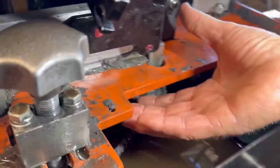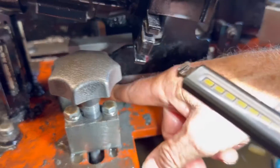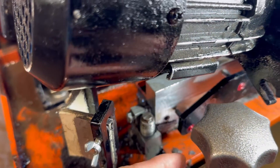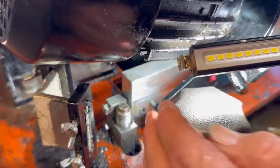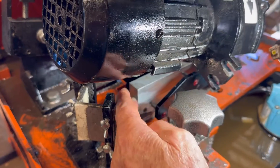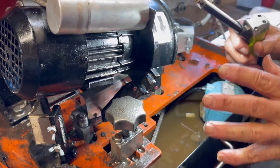In the case of this machine, there are two bolts right under here at the end of where this finger is — a bolt that goes through this block. You loosen that bolt and one right here, and then you can pivot this blade guide plate. You can see there are notches which allow the blade clamp to move forward or backwards to align it with the three bolts in the alignment tool. Once all three are flush with the plate, the machine is aligned. On this one, the closest pin was touching, the middle one was not touching, and the far one was off about a sixteenth of an inch. When we loosened it up, we adjusted the plate so all three were touching, then tightened it back down. That's supposed to put this machine back into perfect alignment.